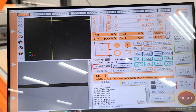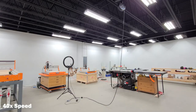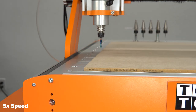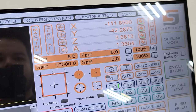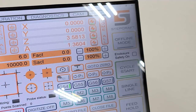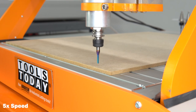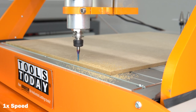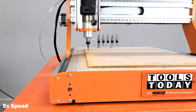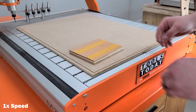I saved it to a thumb drive, went over to the computer I use to run the CNC, and you can see a little preview of what that's going to look like. Now it's time to get all the cameras set up — this easily takes just as much time as everything else on these projects. I set the X, Y, and Z zero, hit cycle start, and we start cutting. The down cut action of the bit leaves a really nice clean top surface. This is done — I'll get it vacuumed off and we have our reference point, so now we can move on to a test piece.